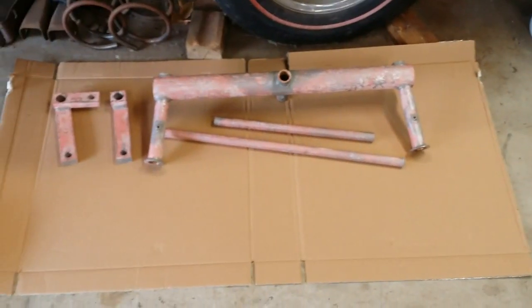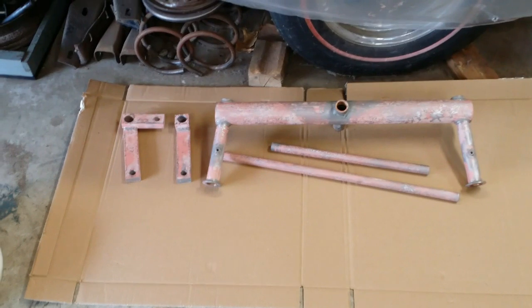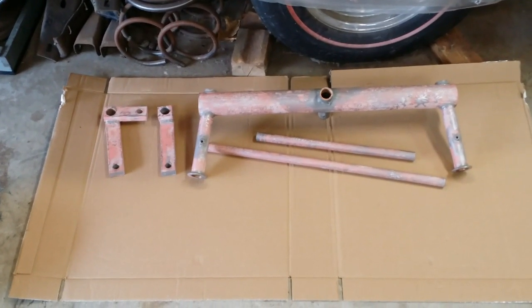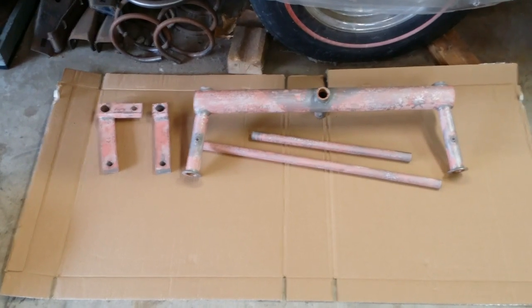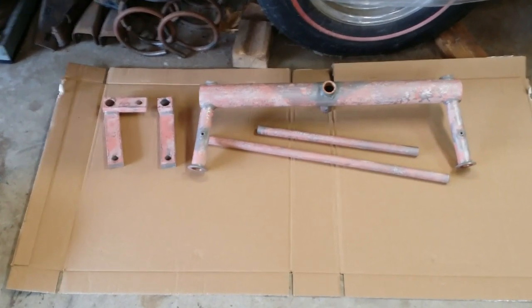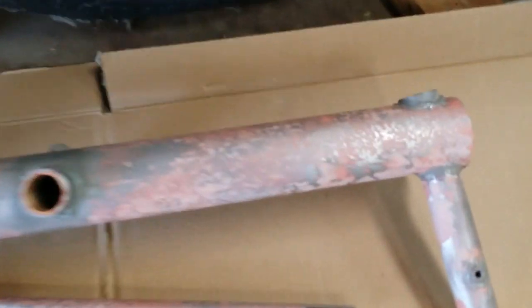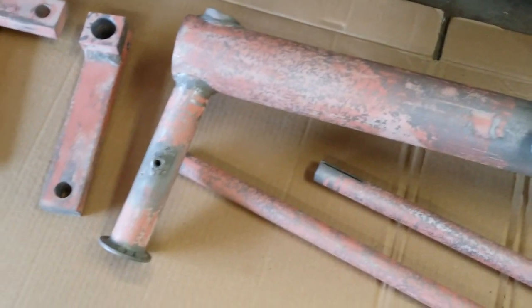So today we're going to continue some work on it. I didn't take video of this because it's body work. You've seen me do it 100 times on the channel. A little bit of body filler, and then I just used the spot putty to finish it all up. And as you can tell, it is pretty smooth. This should primer filler real nice, all these bits and pieces.